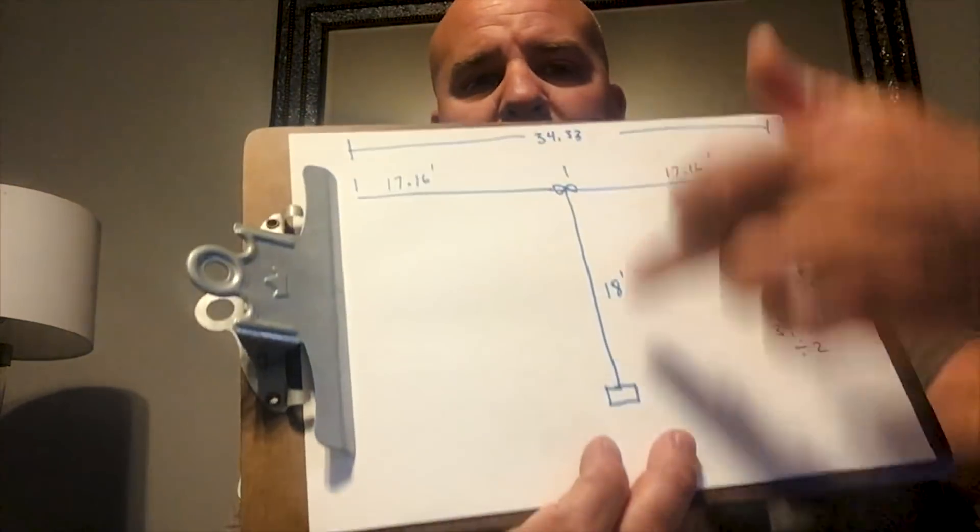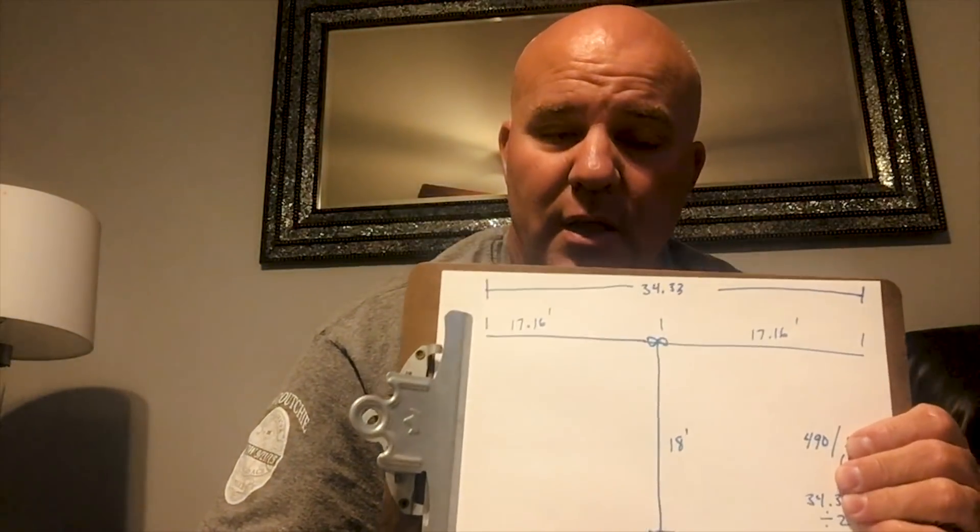The main part of the speaker wire that you don't spread apart is in essence your transmission line. Trying to maintain some distance off the ground — I calculated about 18 to 20 feet as ideal. My fishing pole is 5.4 meters, about 17 feet, so that's roughly it. Sometimes I don't want to sit right where the pole is, so you can make the feed line longer and run it along the ground so you can sit in the shade or lean against a rock while the mast is up in the open.